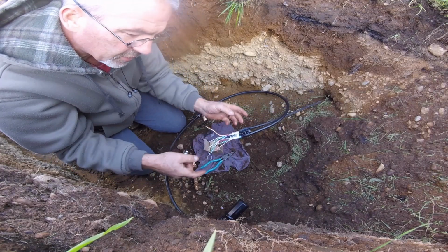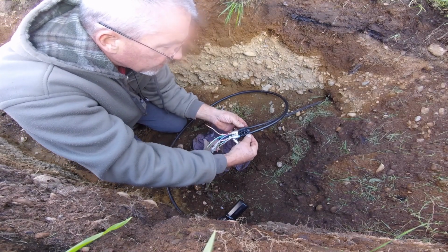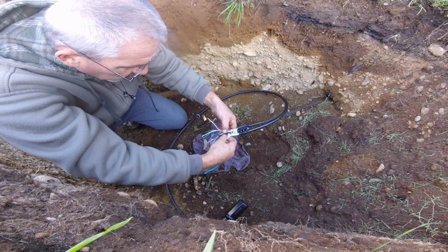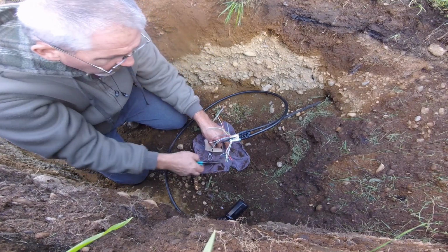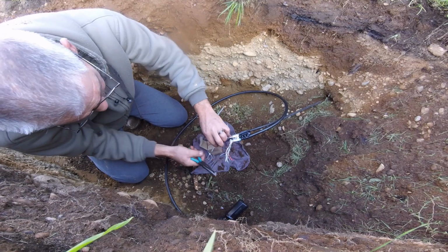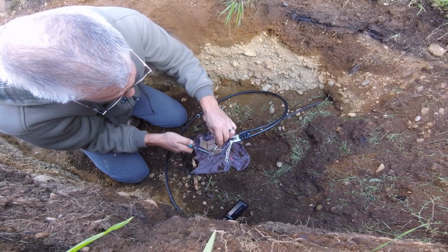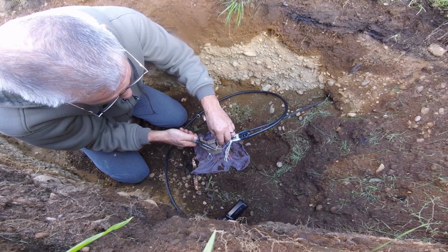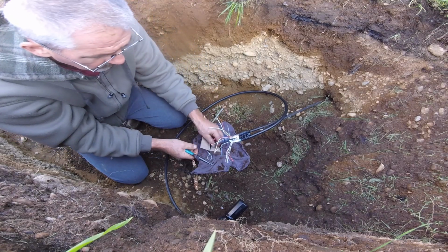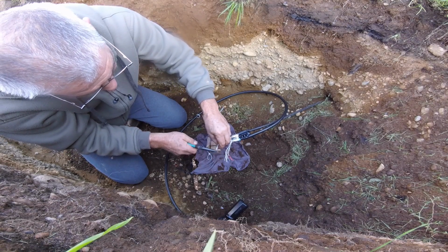This works real good because the cap that goes on there is encapsulated with that gel, and so it squishes around the ends of these, so dirt, water, moisture can't get in there. So once you get that hooked up like that, now you start peeling these off. They got a pretty good system here. These things are called gel caps. And you just line them up. Get them all the way down in there. Squish it. That gel pops out of there. Seals up that joint. Just like so.